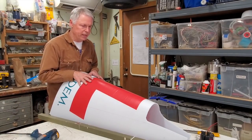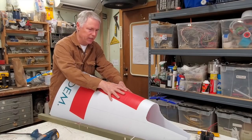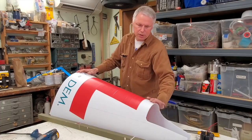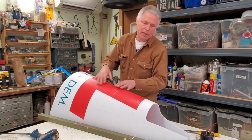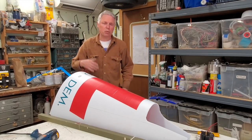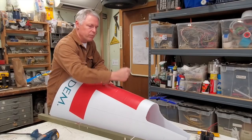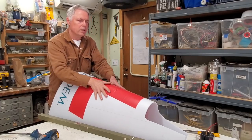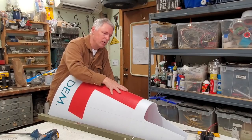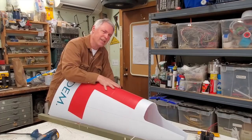On my last build, when I was making the rear cowling, I ran the flutes this way — I didn't think I could get a nice tight turn like this. But I applied heat on the rear section here and got a good tight radius. I like it. The beauty of this is now it is very strong — not only waterproof, oil proof, fuel proof.